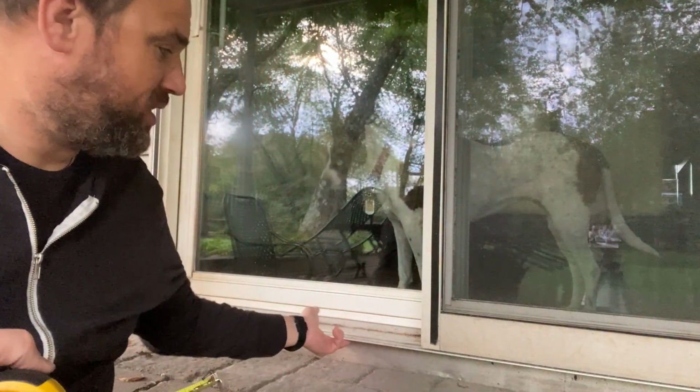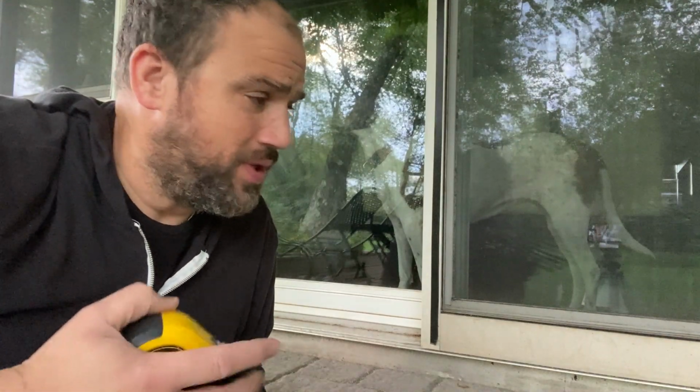But then it'll protect on this. So that's what I think I'm going to do. I think I'm going to go 2 and maybe 1/2, or maybe like 2 5/8. Maybe 2 5/8 might be a little bit better, give me a little bit of room in there. But that being said, don't need to do anything other than that. So we're going to cut the PVC, slap it in there, and throw some glue, probably a trim screw or 2 to hold in place until the glue dries. Maybe if I feel like it, plugging the holes. If not, I'll throw a brad or 2 in there to work it out.